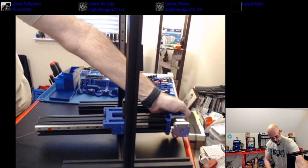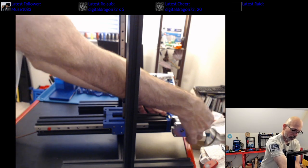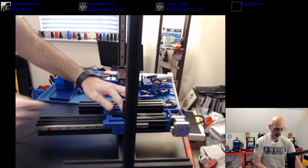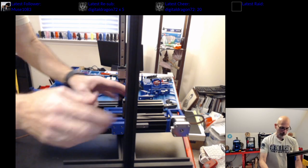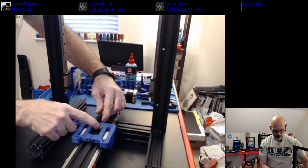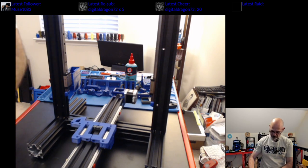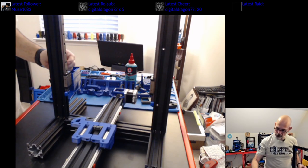There we go. Make sure we come around the pulley. Give me 1 second and double check. Under and over. Yep. So when we go to do this, the belt goes under and then up, and we'll be able to leave some extra tucked in, which will allow us to do some adjustments later if we need to. And we come in from the backside.